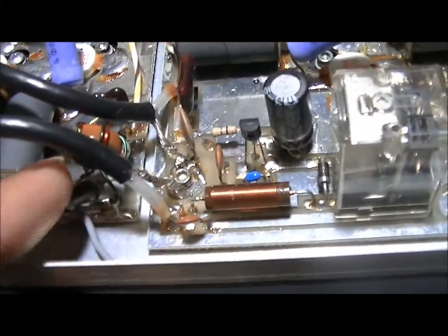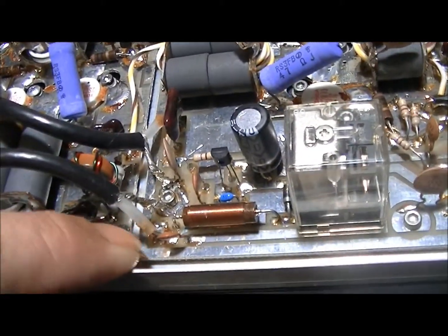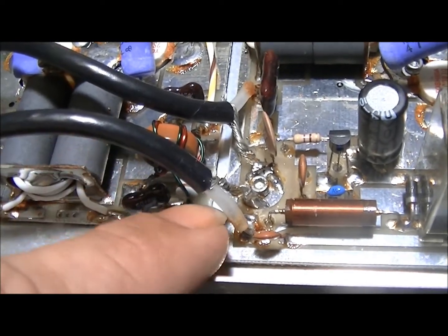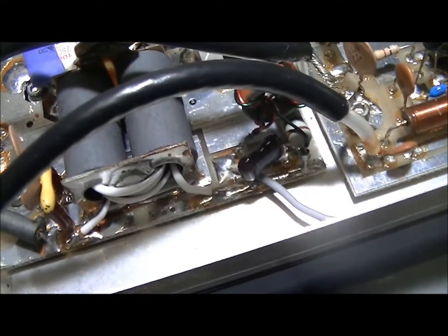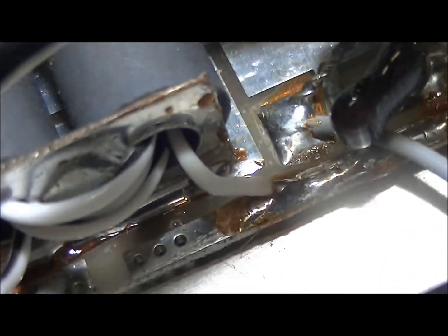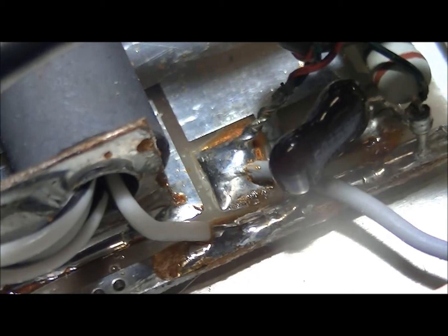There's a little split over here which I'm thinking they're using to correct some input SWR when some of these attenuators are pushed in. One of the biggest differences is the output combiner on these older versions. Instead of having the combiner soldered directly to the trace, they've got it going to this little isolated square - you'll see this square on all the regular boards, it's just an isolated square.